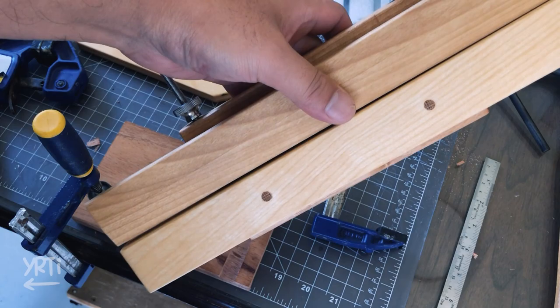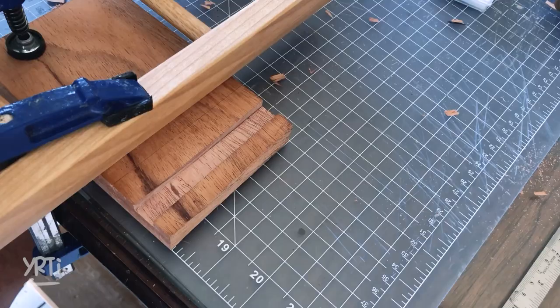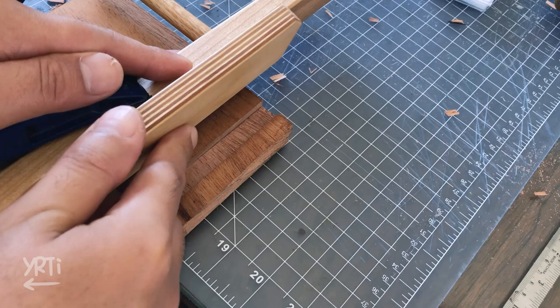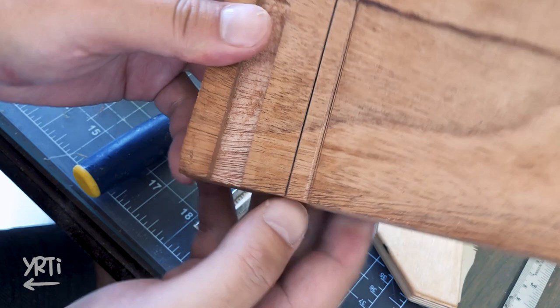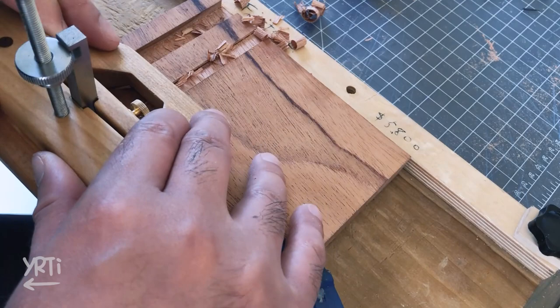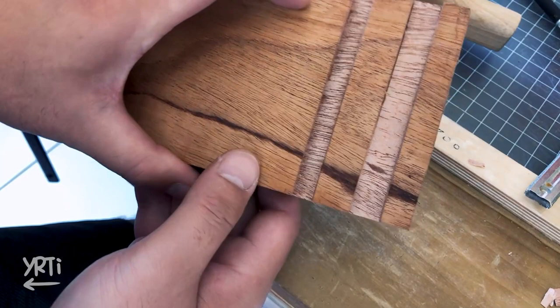Now, the sliding dovetail. This is the guide I made, but I only used the angled guide and clamped it to the wood to make a groove. I was actually planning to fit a brass sheet on the bottom of the angle so it doesn't get worn out, but oh well, maybe next time. As it tilted to the side, I felt a little more friction than the perpendicular cut line, but it was alright. The blade lube actually helped me a lot. Though I happened to cut a little bit too inside of the lines, I was so happy with how accurate it went. Then I used a router plane to clean it up. I could have used chisels, but as the grain is already cut off, it's easy to clean up with whatever tools are available.